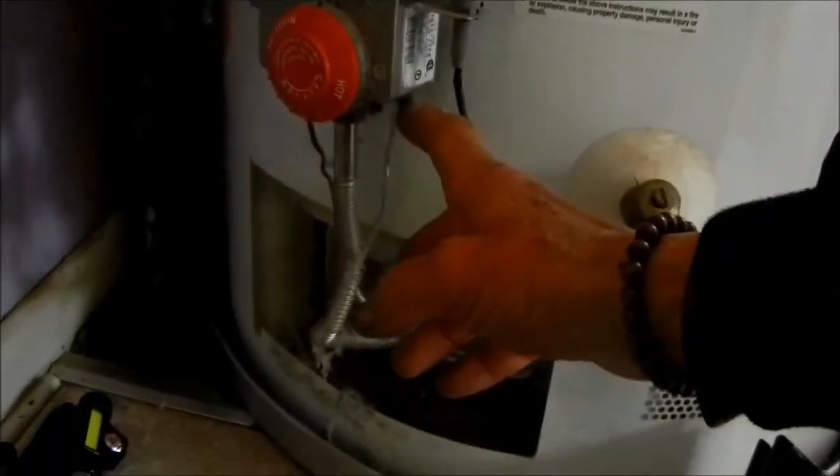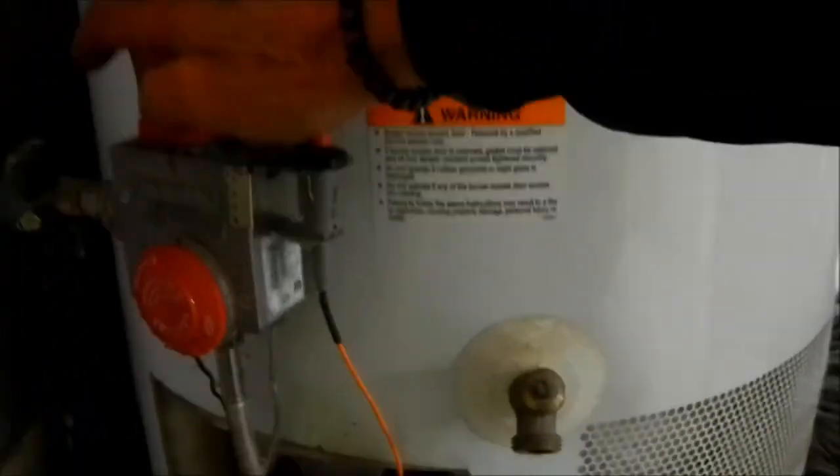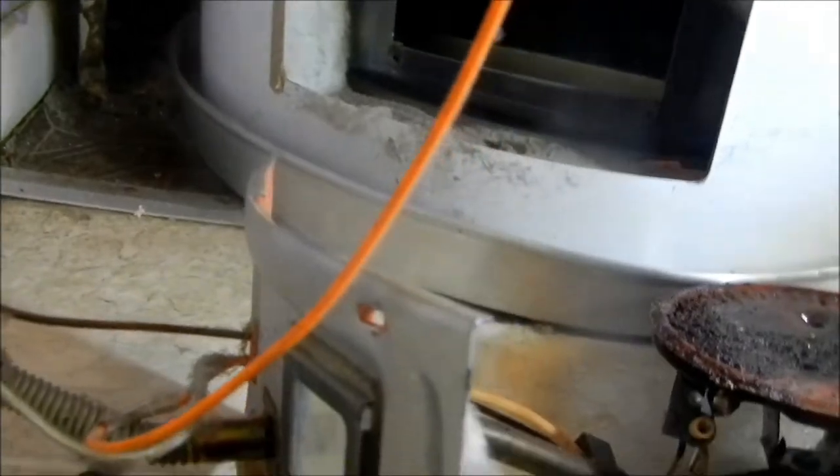I need to crack this line, push the pilot light, and see if I smell gas. We got the burner assembly off — you have to disconnect it from the valve. Looking inside here, it looks kind of wet. There's a breather hole right there on the bottom; that screen should be clear. This water on the bottom of the pan should be out of there too, but we still have the pilot light issue at this point.